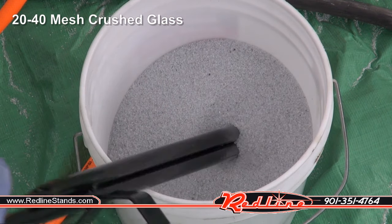I wanna share a little trick with you guys that I've learned. If you're trying to remove powder coating, which is obviously very difficult to remove, watch what happens to the powder coating as I heat this stuff up. It'll start to sparkle, and literally little pieces of it will come flying off as I burn up the powder coating. So I'm gonna go through here, heat this up, kind of char that powder coating, and then when I hit it with my blaster, that stuff is gonna come off like the cheapest paint that ever was.